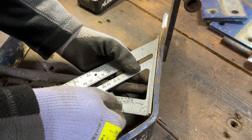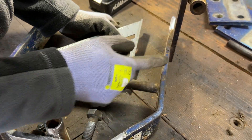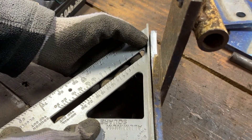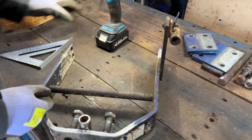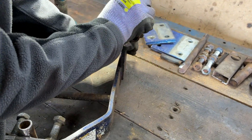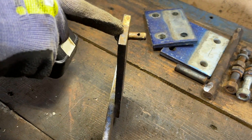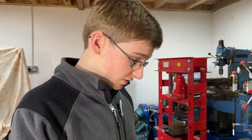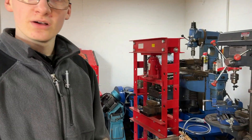If we go towards the back, the part on this side and the other side — you can barely even see that there was ever weld on them, so that's good. However, we spotted something rather unhelpful while we were doing this. If I put the straight edge on here you can see this pivots on here, which means this part is bent outwards. And if we go to the end you can see there's quite a big gap there from here backwards where it's been bent outwards too. This part going up appears to be bent at a slightly strange angle, and if I take the pin off you can also see that this pin is bent backwards too.